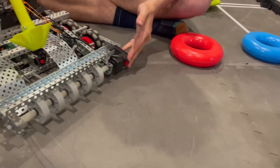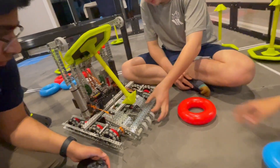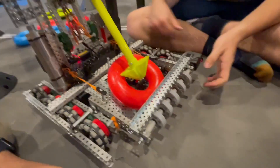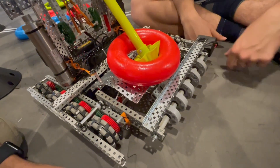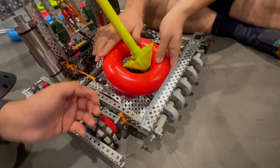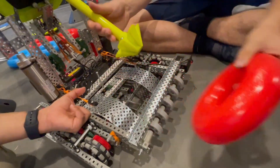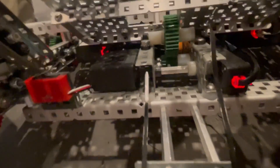The intake is the last thing we designed, so it's still yet to function perfectly. If we had more time we would have raised it higher, and after that we have this part which raises up. Squashed down in the bottom of the robot we have a 5.5-watt motor powering a double-slipped 12-tooth plastic pinion — that's our slip gear. The 5.5-watt had horrible friction because of how they're made.